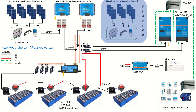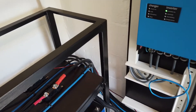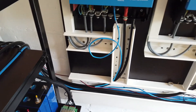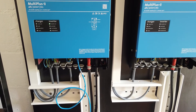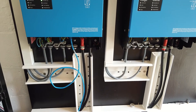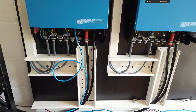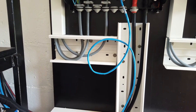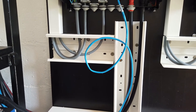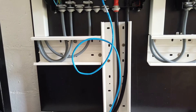We've covered solar and battery — let's move to the final part: AC. The 70 square millimeter cables go via this cable gutter system towards the inverter. Make sure to use cable gutters that are large enough; I started with smaller ones but quickly changed my mind. If you have to bend these thick cables it becomes very challenging — it simply won't work. Make sure you use large enough gutters: 8–10 centimeters will do the trick.